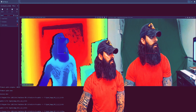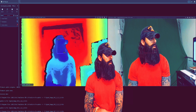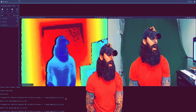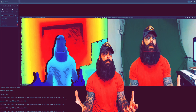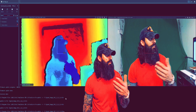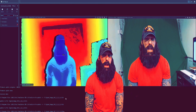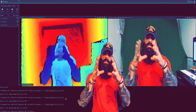In the command prompt, type cmd into your terminal. The key command is rs-fw-update then -r for enumerating connected devices on USB 2 or USB 3, and then -f followed by the location of the .bin file — for example: signed_image_UVC_5_12_5_0.bin. Since I've already done my firmware update you won't see it progress from 0 to 100%, but you can see it shows firmware update started, progress to 100%, and completed. I actually had to recover this camera because upgrading firmware in the RealSense viewer completely bricked it — it took me almost an hour to recover.